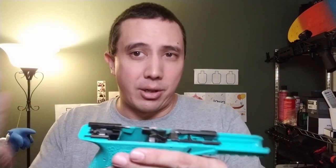Something Alpha Romeo on Five Another YouTube channel brought up was that in the transition from Gen 3 to Gen 4, the Gen 3 parts had a change in materials and potentially geometry, specifically around the extractor. Not exactly sure what was happening there, but a common fix was to use a Gen 4 ejector in the Gen 3 system. I was obviously looking a lot at the ejector since I was having ejection consistency issues, so this seemed like a reasonably easy fix.